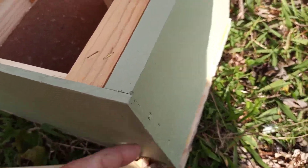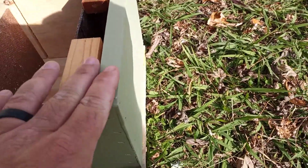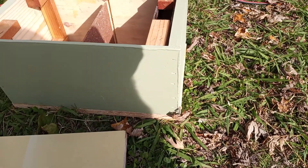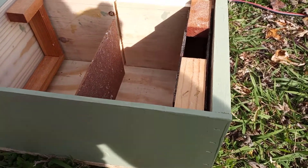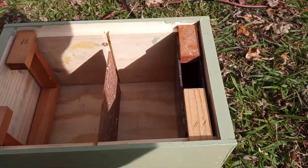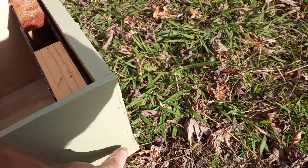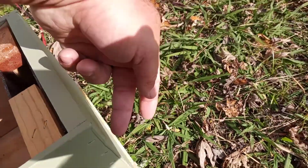I routed the side so I could create a rabbet for it. This is just shelving board — went to the local hardware store and bought eight inch shelving board, which comes out to seven and a quarter. I just took some three-quarter inch plywood, which made it a little heavy I think, and I stapled both directions — stapled down this way.